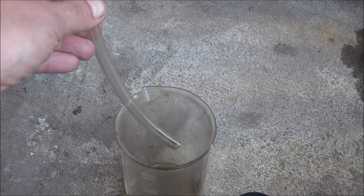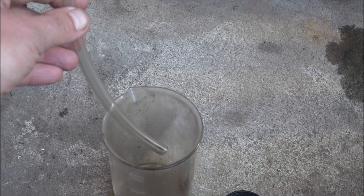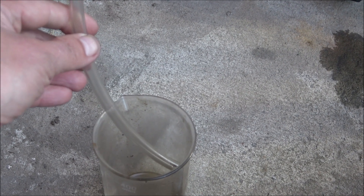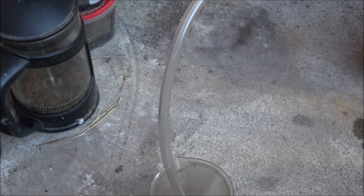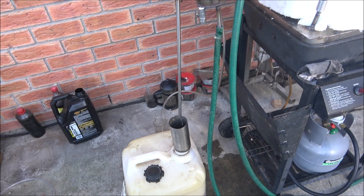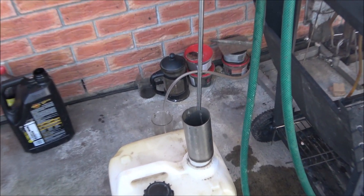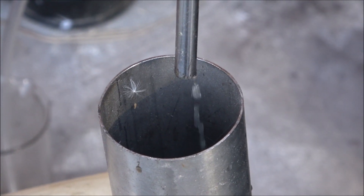I've got a small flow of petrol as well. I still need to check this petrol and possibly would need to run everything through the petrol separator first to retrieve whatever petrol there is. The intention was to make a machine capable of producing just predominantly two fractions: one is diesel fraction, and another one is a petrol fraction.